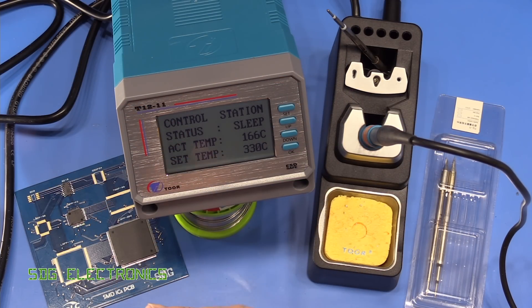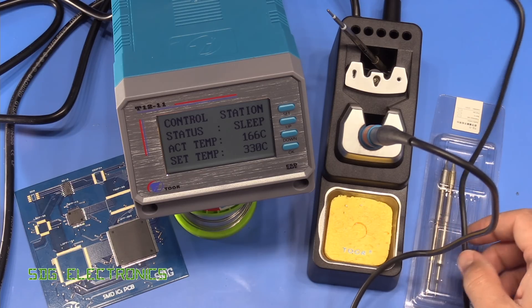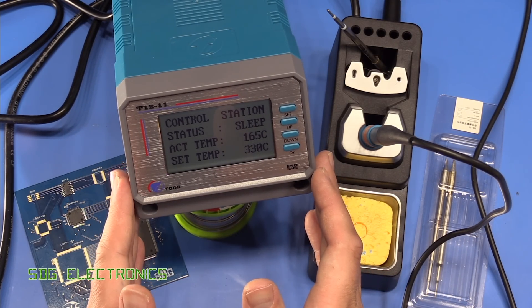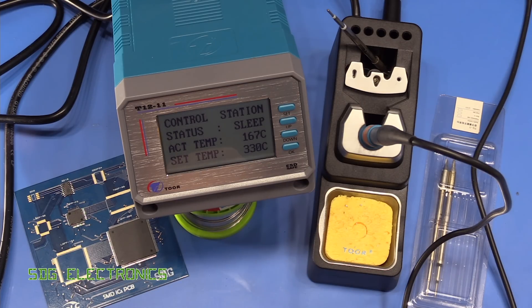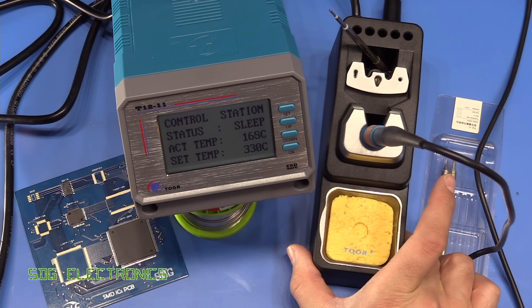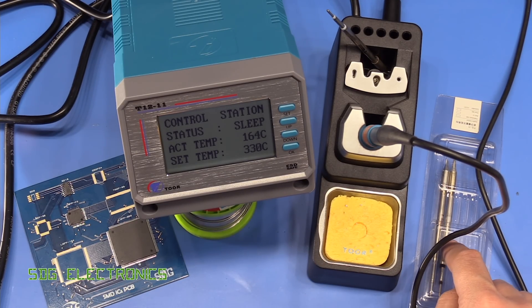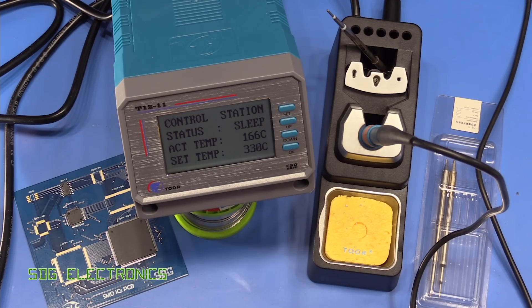So that's a look at the T12-11 soldering station from the Eakins store, and overall I've got no complaints over this system. It does feel really quite robust. The stand that's remote from the unit and the way that the handpiece plugs into it is really quite a nice feature - you've got about 1.5 metres between this and the stand, which means this can be sitting up on a shelf out of the way. Generally speaking, you shouldn't need to change it from 330 or 340 degrees C for the majority of soldering tasks. It's a really quite well-built unit with a heavy duty stand, but the tips that come with it are fairly useless, so I'd consider buying some additional tips. I'll put a link down in the description. Thank you to JLCPCB for providing the PCBs, and until next time, thanks for watching.